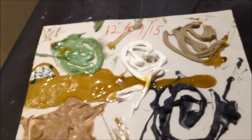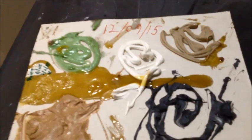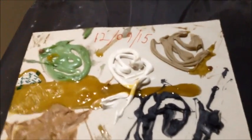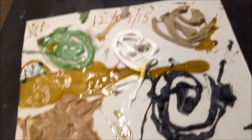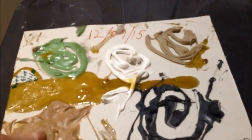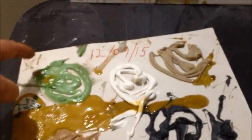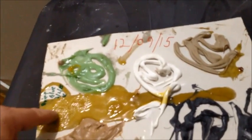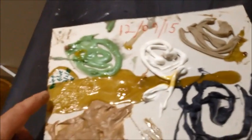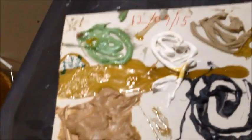I will say that as far as ease of use, the green glue and the quiet glue were equal to work with. They came in the same size tubes. You have the same type of nozzle. It goes on almost identically the same. So there's that. This stuff here is this carpet glue that I was turned on to. Now, this has been on here for months now, and you can see how it's still pliable, which I thought was pretty darn slick. And when you're talking just cost, the green glue is $190 to $220 per case, depending on where you can get it from. The Quiet Glue Pro, I found about $119 to $130 a case, but the carpet glue, I found at about $40 for 4 gallons, which was quite a big savings.